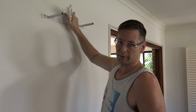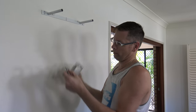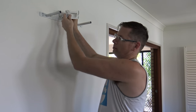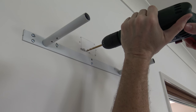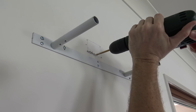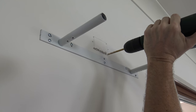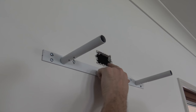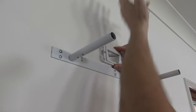This is where I'm going to mount the screen controller bracket. I'll feed the cable up and also use one of these clips to give it something to screw into, because otherwise it would just be loose on the gyprock. I'll cut that out and mount it here. The way I do it is I just chain drill where it's got to go, all around, and then that section just falls out. Then I can put the bracket on there and feed the cable up once I've drilled the hole at the top so it can make it up to the roof.